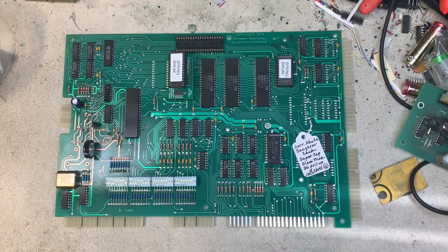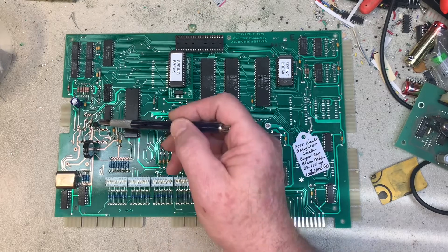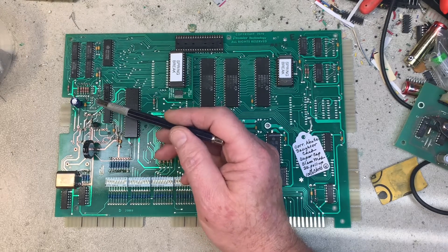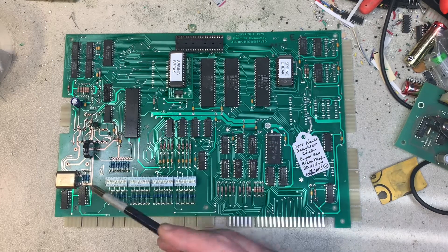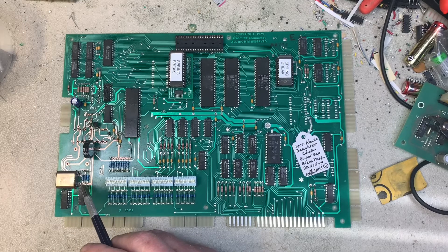We are back with this board again. I've cleaned up the reset section by scraping off all the parts, sanding down to bare copper, and now I have conformal coated that area and reinstalled the parts necessary for this board to work. These 4.7K resistors are back in. The switch bank had no corrosion underneath it so it's reinstalled. Here's the DS1811 reset generator — it's actually a different part number but we always call it the DS1811. I always replace this power filter input cap, and some jumpers are in where the 4528 used to be.